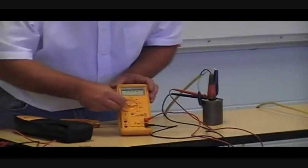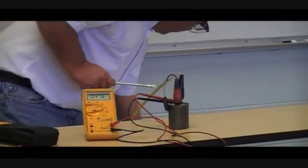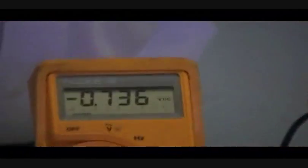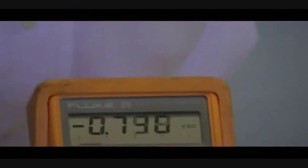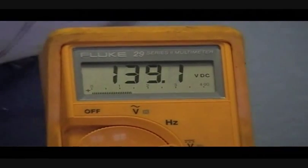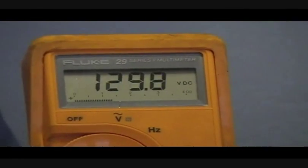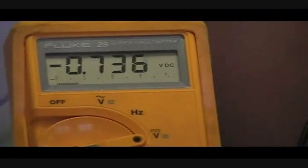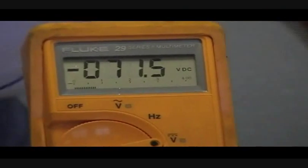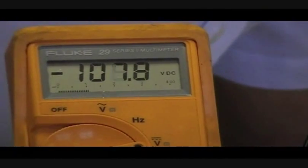Here's the problem. We were measuring AC voltage. Now I have flipped to the DC volt scale. Once again, I plug it up and I'm reading very little DC — in fact, less than one volt DC. We know it's plugged in; there's voltage there. I unplug it and suddenly I read 135 volts. If I catch this right, I would actually measure peak voltage. I am trying to unplug it at a point that would be close to peak voltage.